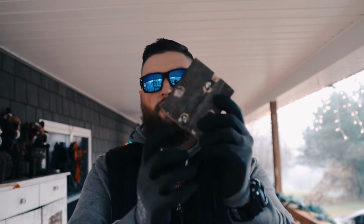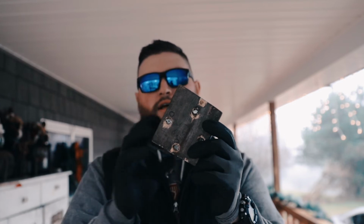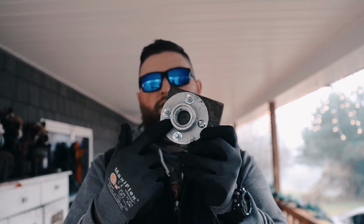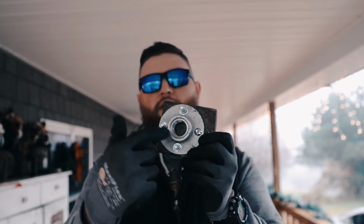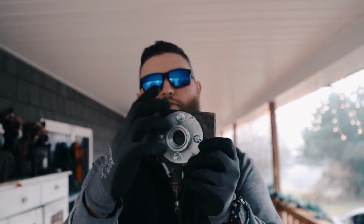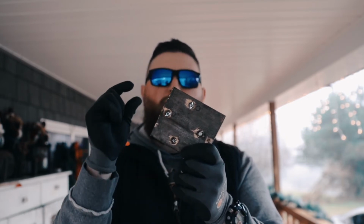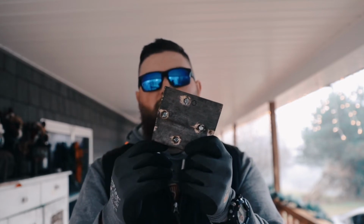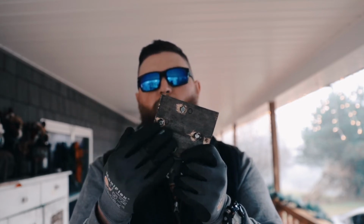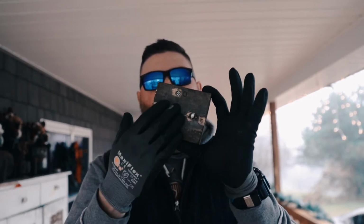All right, so we're back up top here. I basically took my 2x4 that I cut 4 inches long. I put my floor flange on it, marked my holes. I drilled each one of the holes out for a quarter inch, and then I took a half inch and went through on the back side and recessed all the holes probably halfway down. That way the bolt head would sit up inside of the piece of wood and the bolt heads wouldn't be hanging out, because this is the side that the camera will sit on.